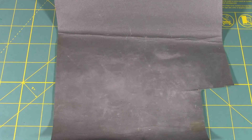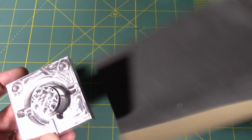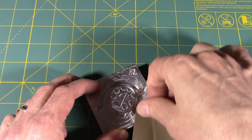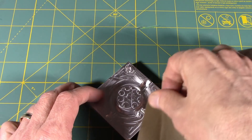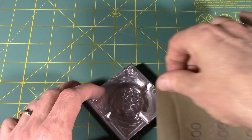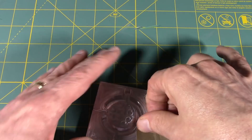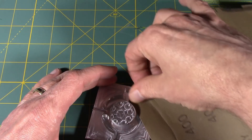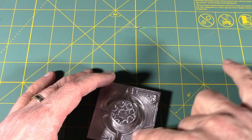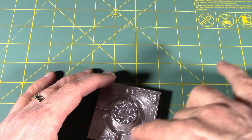I think the burrs are gone — I'll have a close-up look. That feels pretty good, but I'll find out by looking under a microscope. Now I'm going to just sand a little bit along these edges as well, and that little bit of sanding will help get rid of the burr on the top.